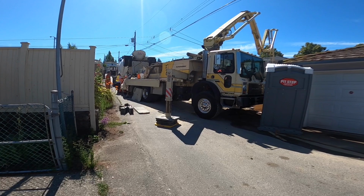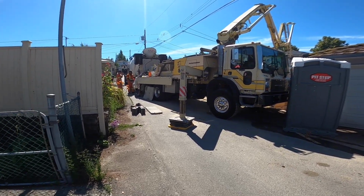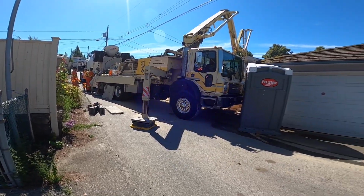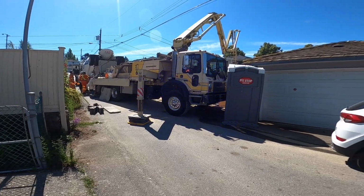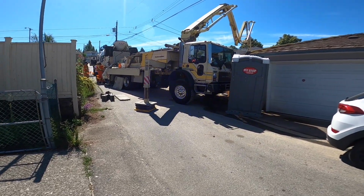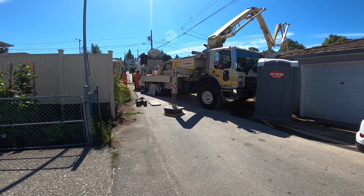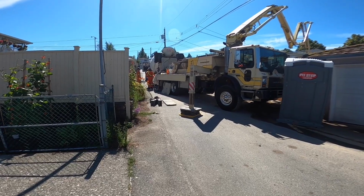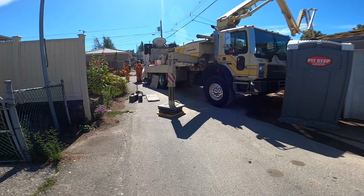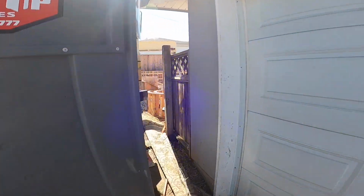Okay, here we go. Concrete has arrived. It is prime time. Being that this is training day, they have used bentonite in the prime port for priming this little Z-boom. Typically, I would just use water, but bentonite is kind of like the training wheel for the new guys. Pretty much foolproofs it. So we will get this stuff through, and then see what kind of working range we ended up with here.